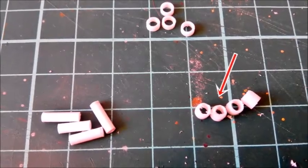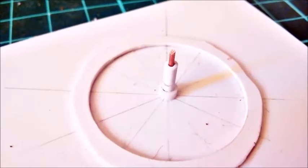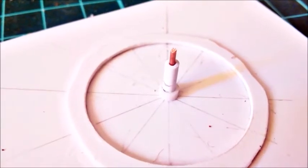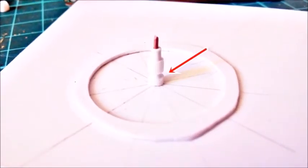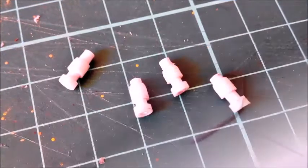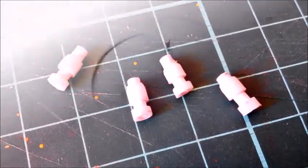Next day I woke up with a picture in my mind and I started building the hubs according to that picture. Instead of trying to drill holes into the outer tube, I split the tube and left 1.5 mm space between the parts. The jig was very useful for the assembly. The copper strips were glued into place and the hubs were ready for the spokes.